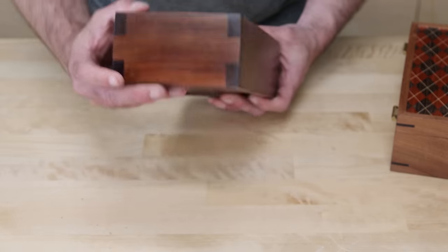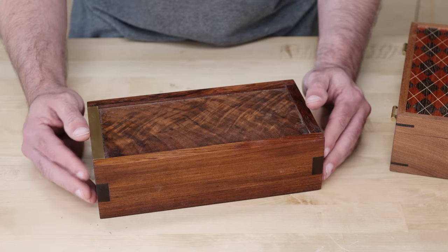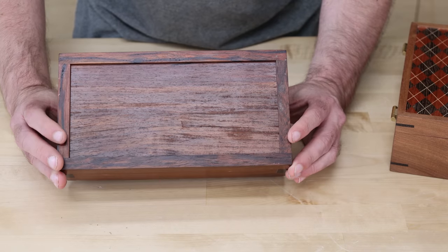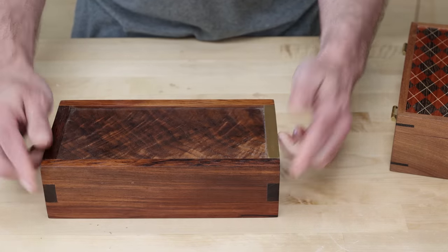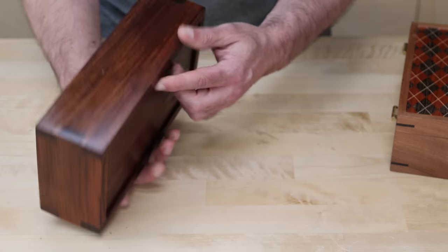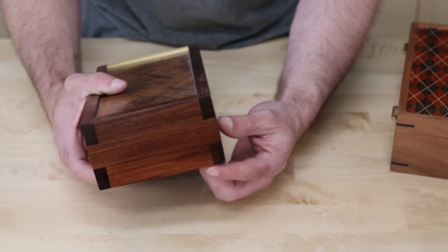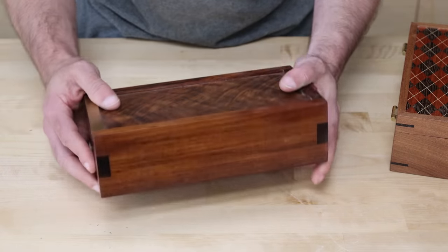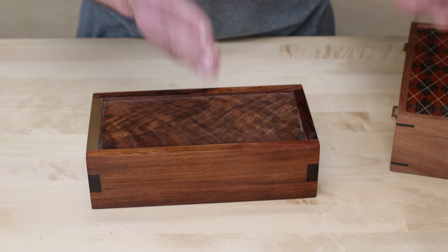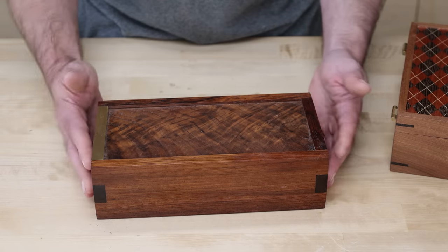As far as the joinery goes, instead of doing miters, I did box joints — just a really simple box joint. I like wide box joints; if you make them super thin, they're sometimes called finger joints, but it's really the same thing. The bottom, again, is a panel encapsulated in a channel. However, knowing how you're going to do the joinery depends on how you're going to do that box bottom. Because I did a box joint rather than a miter joint, I couldn't just route a channel all the way through — you would have seen little notches on the ends, and that's not what you want. So I had to take it over to the router table and do a plunge cut — plunge it down, route out the bottom, then lift it up — so there are no entrance and exit points. I still used a solid panel inside of a channel, just done a little differently.